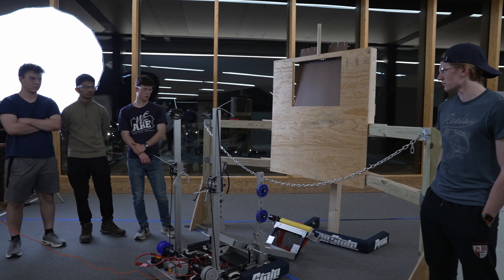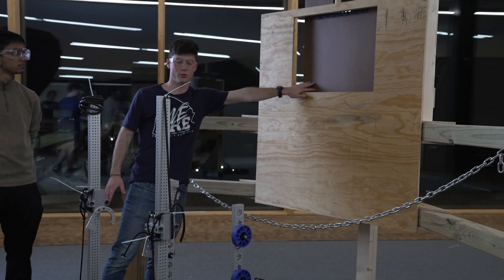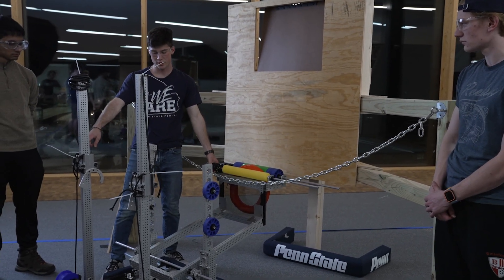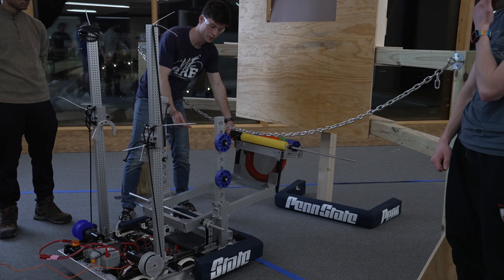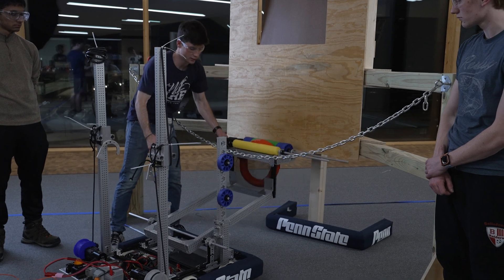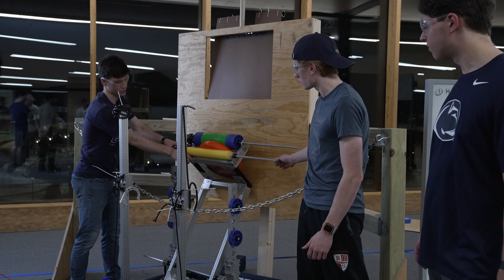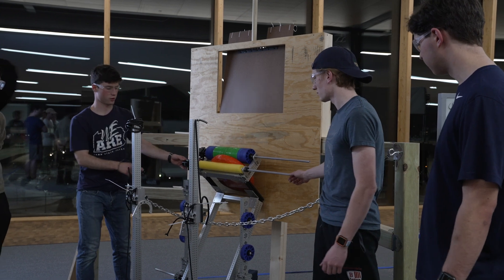The first part of our climber — one of the goals is trying to score the trap note. We're doing that with this arm. The arm flips all the way over, intakes from that side. It's significantly more than the one-foot extension outside the frame perimeter right now, so that's something we'll have to change in the final design. The idea is that the arm starts low, comes up inside the chain, and then we'll have a hook on the arm to grab the chain and bring it down.